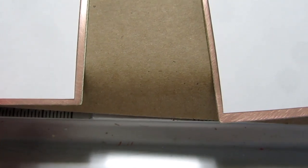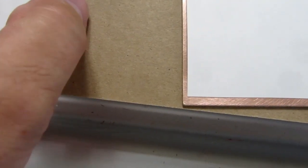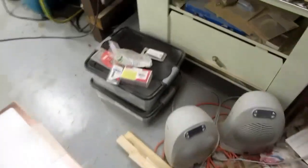I didn't get that with the color LaserJet, but I didn't get good adhesion of the green film when I was printing with the color laser printer. And they do actually caution against that in the technical notes from Pulsar. They say, in their experience, the color laser printers don't use the same kind of toner, and it's just not as good. Of course, by good, it refers to good for this application, not for normal printing, in which case I'm sure the toner is just perfect.